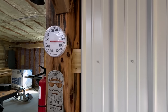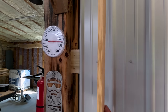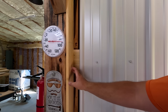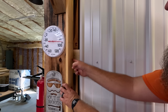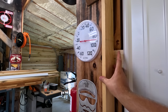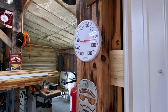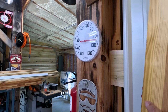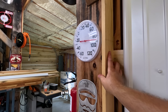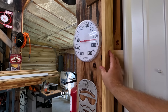Here's what we're going to do. I have a bunch of scrap pine down here — three-quarter, about four inches wide. I'm going to put it against this post, attach it with some nails, and get it secured. Then we'll put some more rat guard right here against this board, and that will extend under this metal and close it up. I want this pine to match the existing post, and that post has been burned — the method's called Shou Sugi Ban, and I'm probably butchering the name. So we're going to go ahead and burn this before we attach it, that way it blends in. That yellow pine against that white pine that's been burned stands out too much.